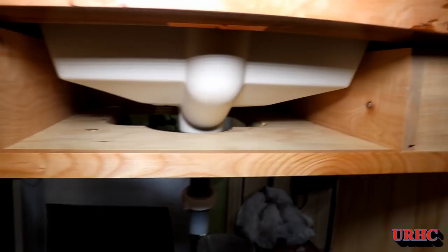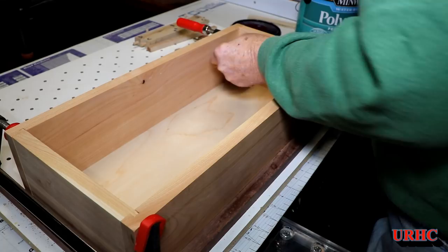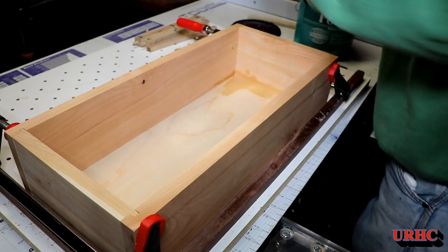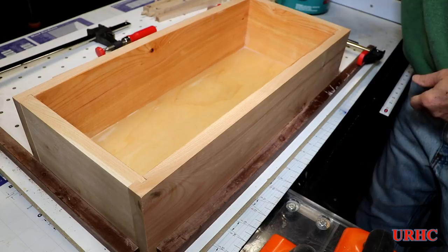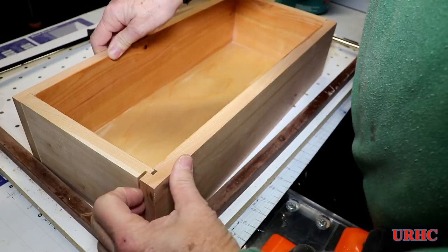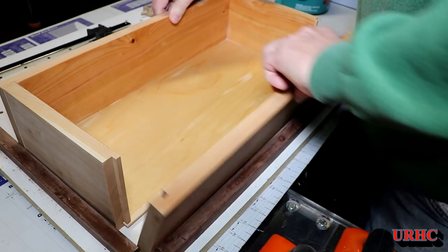That's basically how the drawer goes — and the left-hand drawer is actually an inch wider than the right. Before the glue-up, I wanted the drawers to look nice on the inside, so I actually put a coat of polyurethane on the complete inside before clamping it together — then took it apart to do the glue-up. That was an extra step but worth it, because these aren't just plain plywood drawers. It also gave me a chance to go back and sand off where the grain raised on the inside so I'd have a perfectly smooth finish.